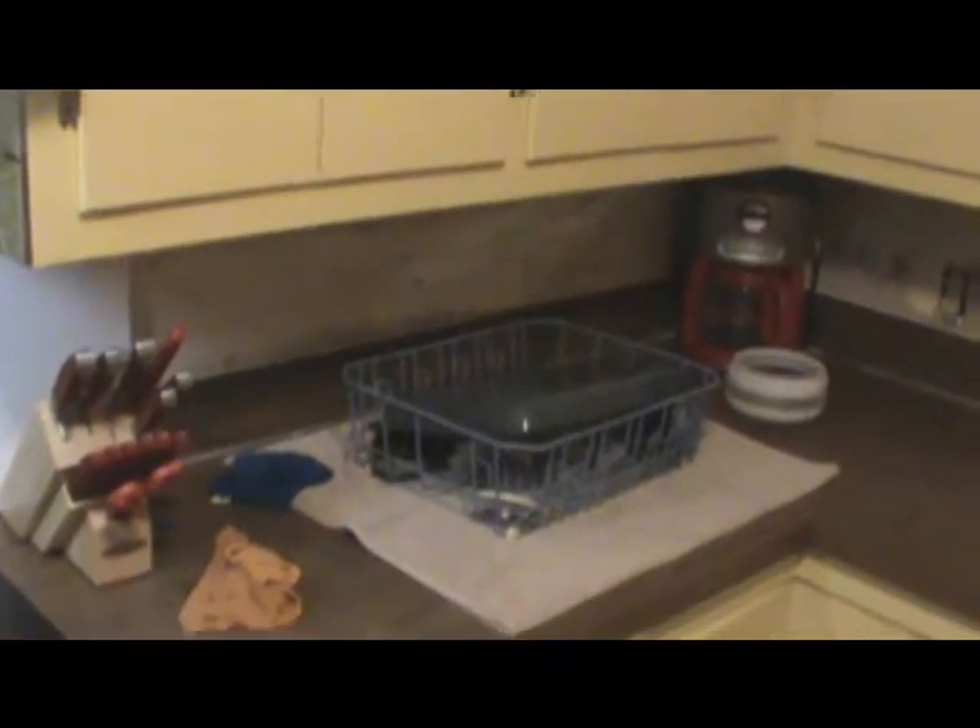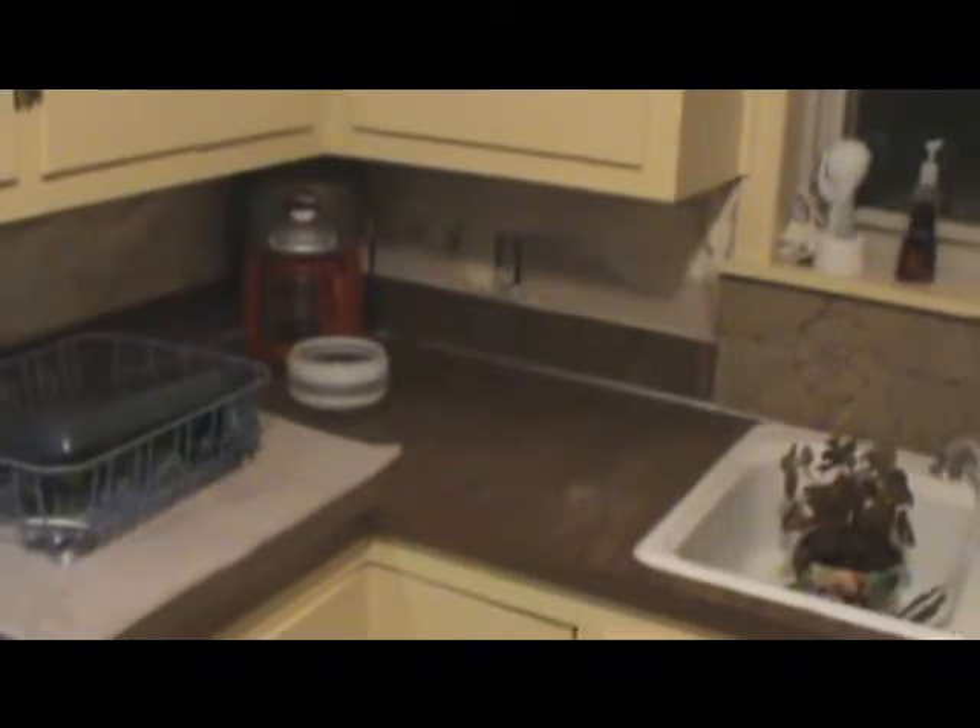After that's all done, we will sand down all the cabinets — all of them — and repaint them white. All the trim around that white. Then I'm going to put in four by six tiles for the backsplash, the same height as what's there — that's four inches high. So I'll do a four by six inch tile along there, stacked like bricks, and around. And up in here I'll redo that with tile too.